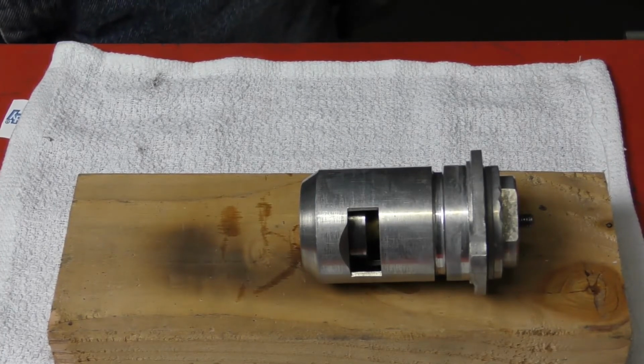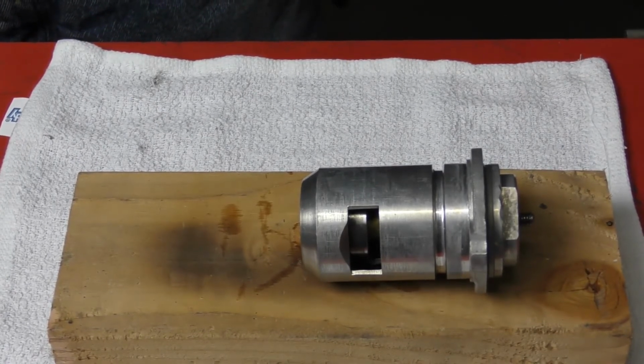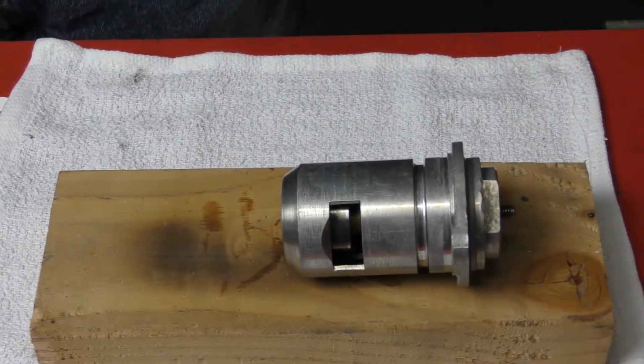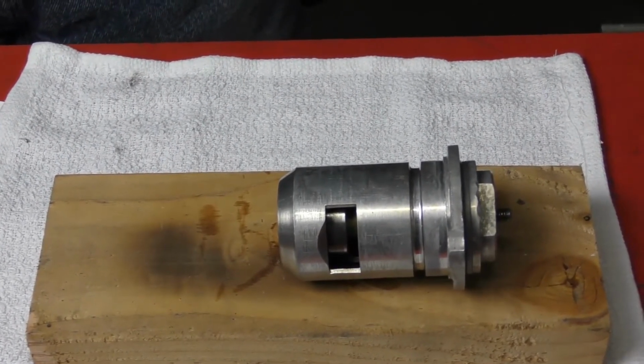This is going to be a plus or minus 10% on that wax pellet temperature rating. So I would allow at least 8 degrees either side of its advertised temperature for opening and closing.